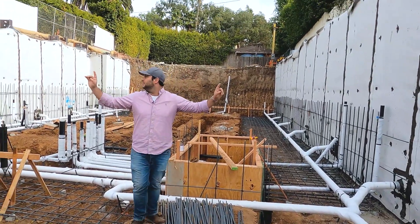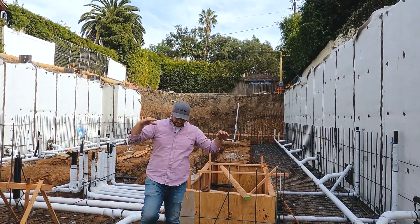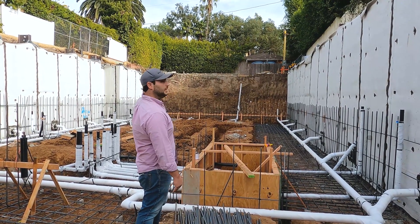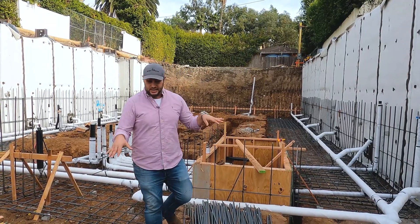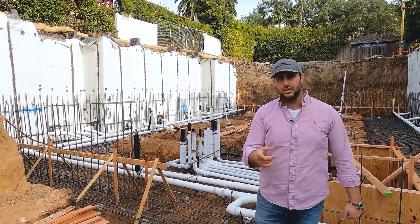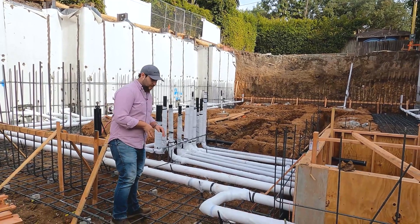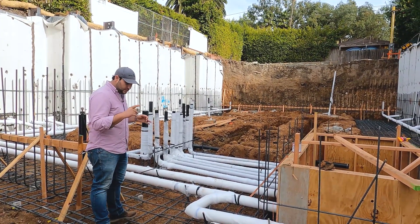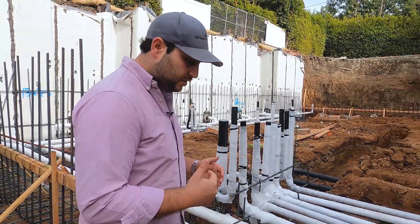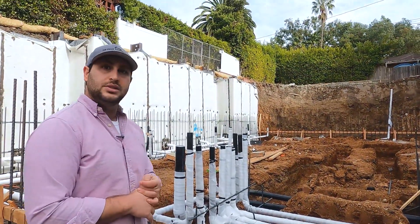You can see very clearly that there are two walls on both sides shoring up the neighbors' houses from falling into ours. Once that's done and our footings are poured, we're actually going to start building the walls — the back wall completely and the front wall completely. Where I'm standing right now is the garage section, so we'll have only half a wall on this side. If you have an idea of how structural this is — a lot of this rebar is oversized and overlapped. Usually rebar is around 16 or 12 inches apart; this looks like it's about eight inches apart. Pretty heavy, pretty secure — making sure this thing isn't going anywhere.